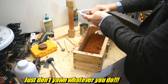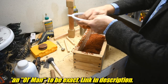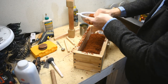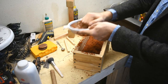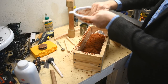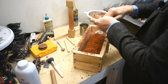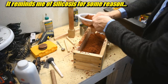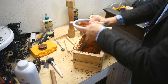I've been watching a bunch of videos by the YouTube channel Old Foundry Man — an old man who does foundry stuff. He uses a facing sand: a very finely grained sand that he puts over the pattern, then just uses normal wet sand over it. I'm not going to do that because I don't have the facilities to grind this stuff thinner. I think Petrobond gives a half-decent surface finish anyway. He does a lot of castings in aluminum car parts, like throttle bodies and that kind of thing.